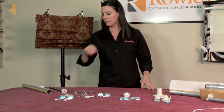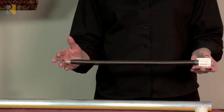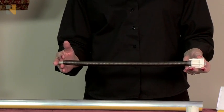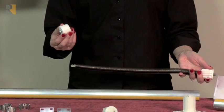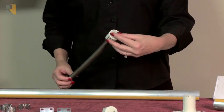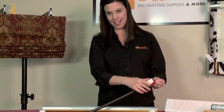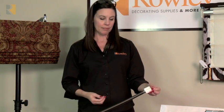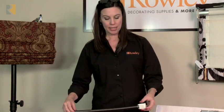Now we're going to look at the roller spring. The roller spring looks like this — you are limited on your width; you can't make a roller spring shade smaller than the spring itself. The spring end fits in one end and has a flat pin, then there's an end plug that goes in the other end. When the flat pin is in the bracket and the shade moves up and down, it tightens the spring — it gets tighter and tighter. This is activated by raising the shade up and down. If you over-tighten your spring, you want to purposely let it spin out so that you can loosen it up and tighten it again.